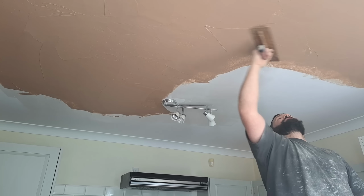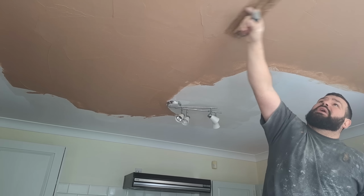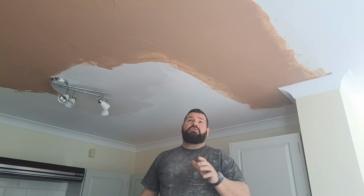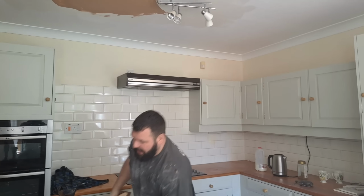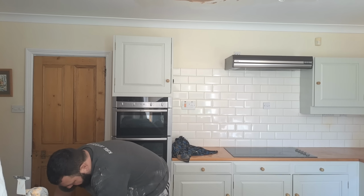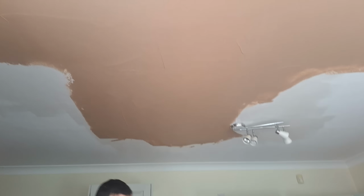and it'll go. But you have to deal with that a little bit each time, and the way to deal with it is to wet it. Okay, don't panic about it, it's not an issue, you know it's going to happen, so you've just got to wet it down. It's just because the plaster's on thin, and it's drying out. So that's what happens, it doesn't want to blend in as it's not thick enough. So that's why you're wetting it.